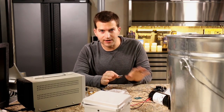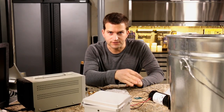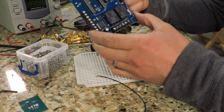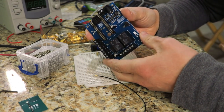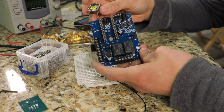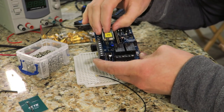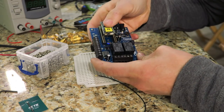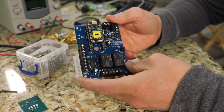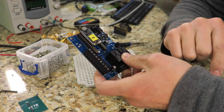The rest of the board is power supply and relay controller. You'll need 12 volts since you already need that for the motor. The Photon requires 5 volts, so I'm using the NCD.IO 2-relay board — they make boards for various platforms and the Photon is one of them. What's neat is you can swap out the Photon and put in the Electron, making this a cellular chicken feeder instead of Wi-Fi. So if it's way out on your property, you don't have Wi-Fi, or your Wi-Fi is sketchy, you can hook it up to your favorite cell carrier — you just take out the Photon and the Electron fits in the back.